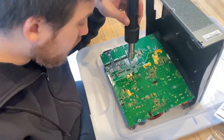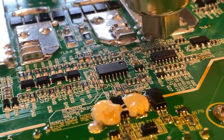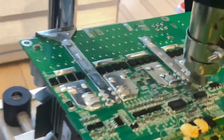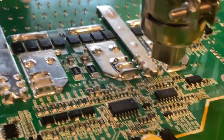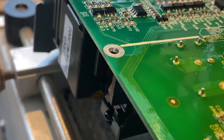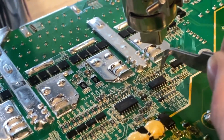Our R126 is coming off. It's almost off — there we go, now it's lifted. So now what you're going to do is replace that with either a bead of solder where that used to be, or we're going to swap it with a zero-ohm resistor, which is this one right here. You want to place that on there and hit it with a little flux. Now Spencer's going to insert a zero-ohm resistor into that existing slot. Instead of just using solder, he's going to replace it with an additional component — a little more professional, but literally the same idea.